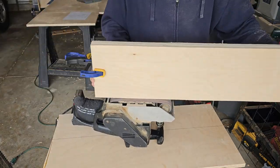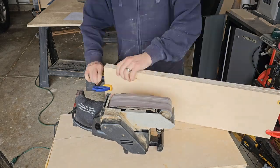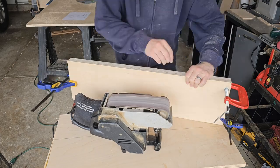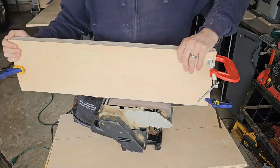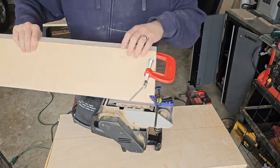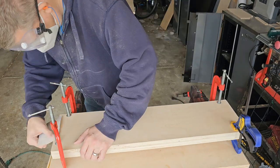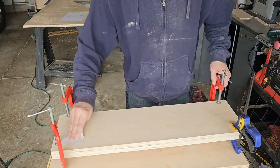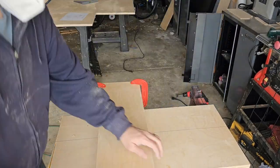I clamped the two side panels together using four clamps in each of the corners and, turning my belt sander upside down, sanded the edges until they were flush. This makes the two panels as identical as possible when doing it by hand, and I was able to get the panels down to the correct dimensions. I repeated this process for the top and bottom panels, then using 150 grit sandpaper I removed any remaining burrs, took some of the sharp edges down a little, and sanded the outer and inner panels to prepare them for paint.